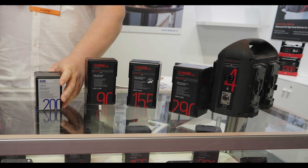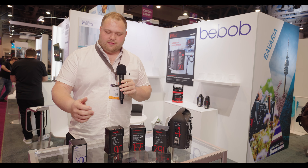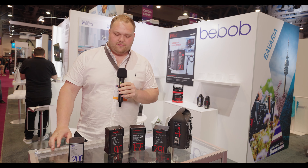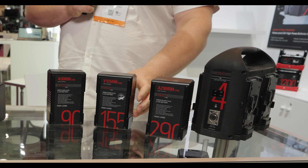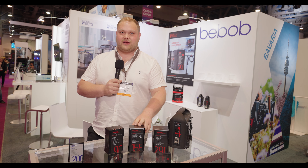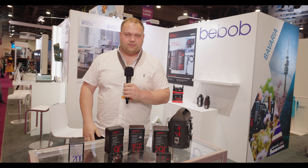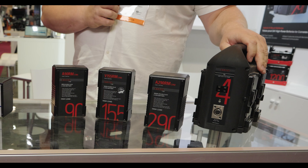We're now moving on from our micro broadcast range to our Cine range of batteries. The main difference is these 200 micros have a maximum discharge of 16 amps. These Cine batteries have a maximum discharge of 20 amps, which when you use our affiliated plate, you can reach that goal of 20 amps. These are ideal for running the Alexa LF and are also becoming very popular for running big lights. As the cells in these batteries are stronger than the micro batteries, we compensate with a two-year warranty rather than a one-year warranty. We also have our four-channel charger here, available in V-mount or gold mount, and that covers our entire range of batteries shown so far.